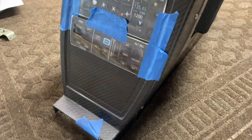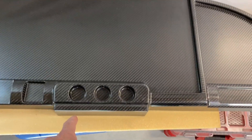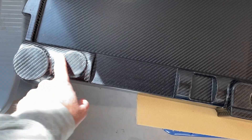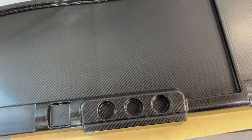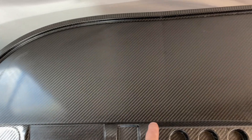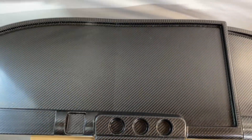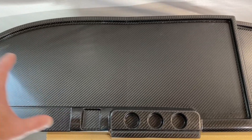Like I said, they're too long. I'll have to order some more from Aircraft Spruce, but it goes together pretty good. At some point I'm going to end up having to drill three holes here — that's where this piece attaches to this piece, but I'm not ready to cut that up yet. I'll check it and see if it's good. I'll cut this whole section out and put an insert in here, leaving a little lip about half an inch all the way around. I can make my own insert, just a temporary one out of lighter sheet metal, so I can kind of cut it up and see how things are going to fit.